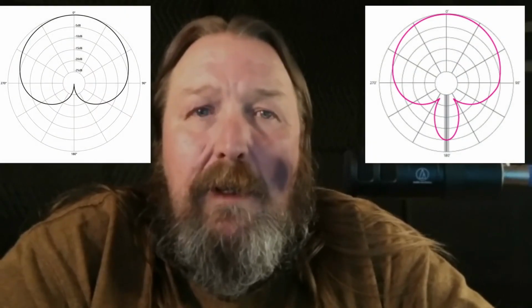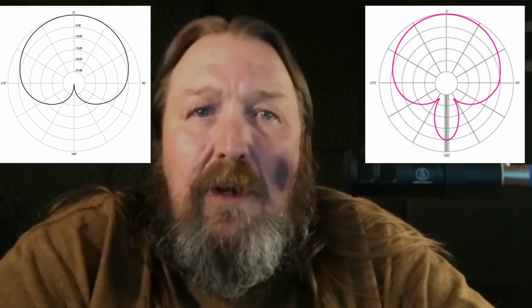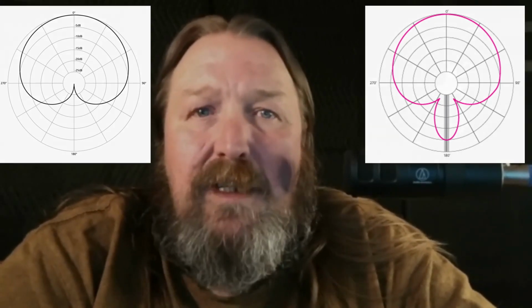So what part of the audio spectrum do we want to transmit? For the purpose of communications, articulate speech is best obtained by boosting the frequencies between 2,000 and 3,000 Hz. Combine this with the fact that low frequencies consume more of your radio's transmit power, and you're going to want to roll off some of those low frequencies. Most broadcast microphones use a cardioid, supercardioid, or hypercardioid polar pattern. The differences are subtle, but just know that a cardioid microphone has its best rejection at the rear, while super and hypercardioids have more rejection to the sides and a small area of sensitivity in the rear.